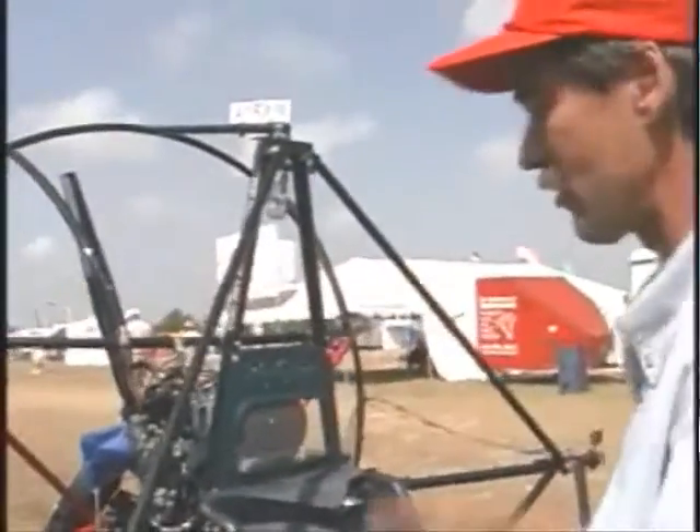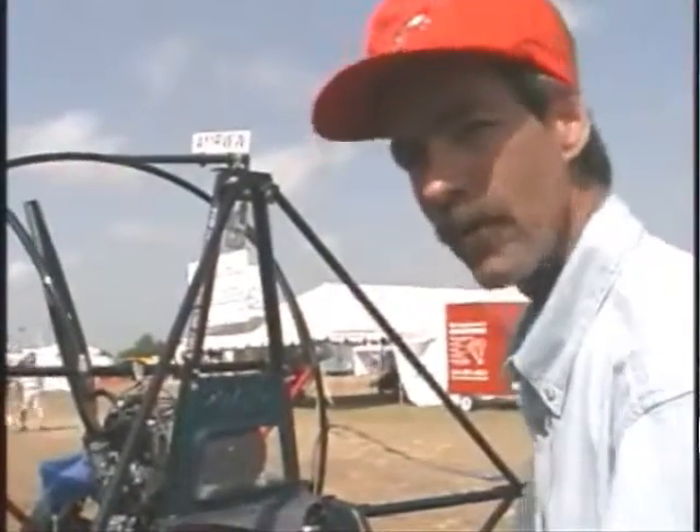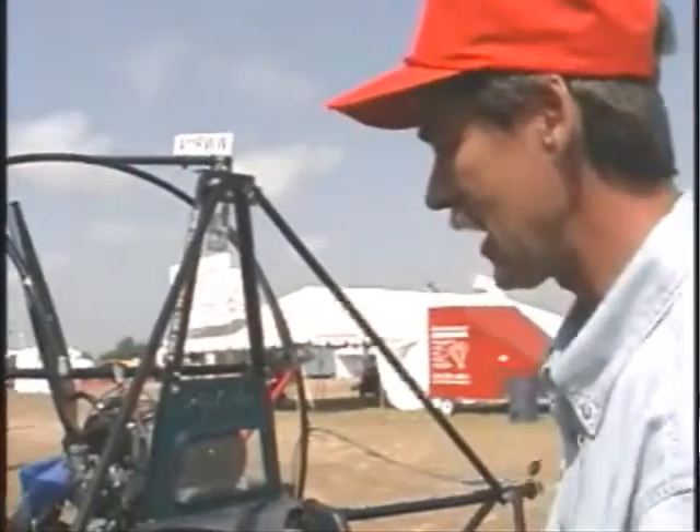To be honest with you, this is not a brand new unit. This unit has 51 hours on it — it's probably about a year old. One of the first things I do looking at a used unit is stand back and do a visual of it. I look at the prop guard ring for symmetry, look for bent tubing, and do a visual of the whole unit to make sure it's never been rolled over, or had a prop strike, things like that.